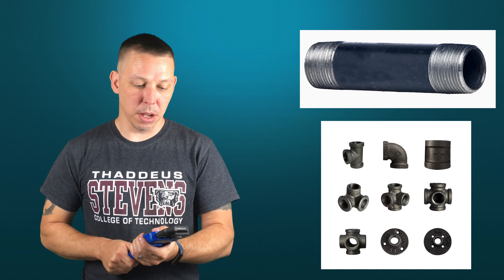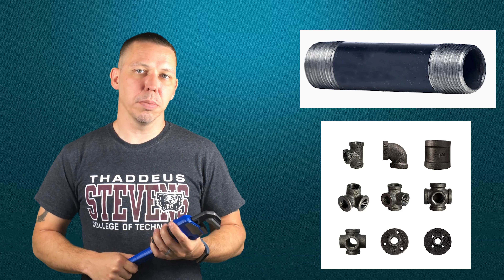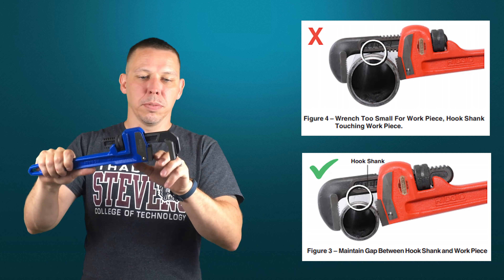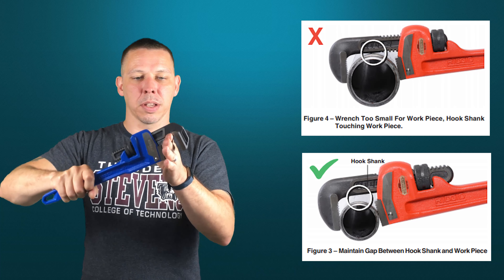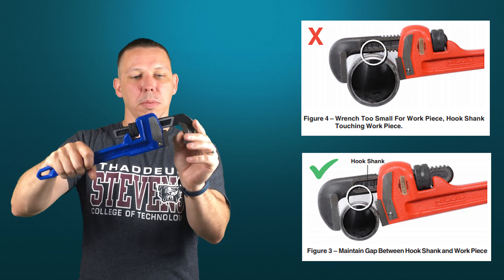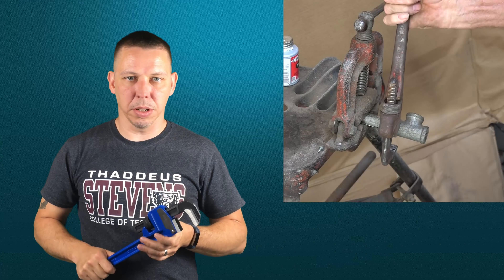These are used for threaded pipe and pipe fittings — black iron pipe and galvanized steel pipe. You adjust the size to whatever your pipe is and want the pipe grabbed right in the middle of the jaws. If it's open a little too far, the pipe sits all the way back against the hook jaw, which holds it open slightly. You want it in a bit so when you turn it, the serrated angled jaws in the front grab into the pipe and it binds between the two.